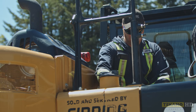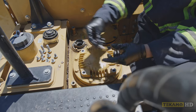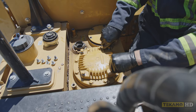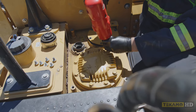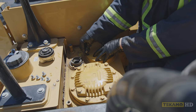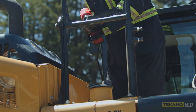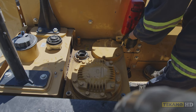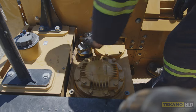Now you reinsert the snap ring again. Then we can take our lid, place it on top, and bolt the lid down. Once that's done, we're going to put the rest of the lids back on and seal the hydraulic tank back up. Because it's spring loaded, you want to go across when tightening. Then you can put the fill cap back on and reinsert the cover.